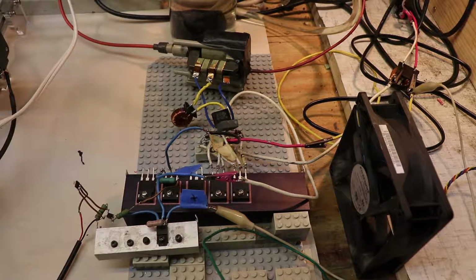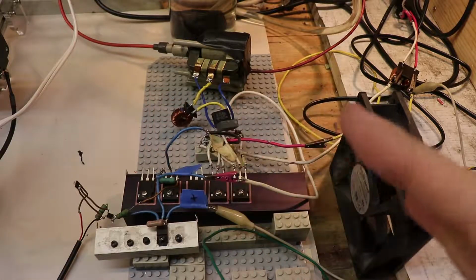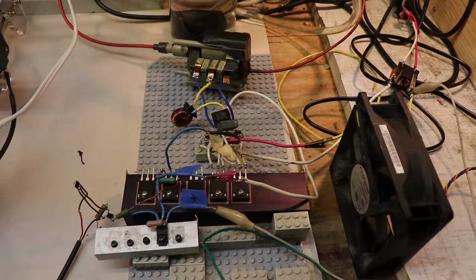And as soon as I started to run this laser with the flyback isolated like this, it ran so much smoother. The computer had zero problems with running any G-code, and it wouldn't have almost any input-output errors at all. It could do long prints more smoothly, and I would be even comfortable to leave the room and not have to babysit the laser while it's doing its thing. So isolating the high voltage really brought out confidence in this machine.